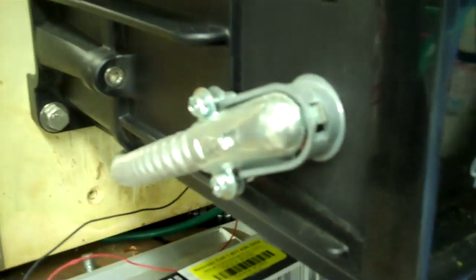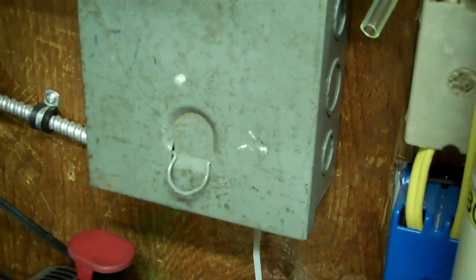It comes out of the inverter in this MC cable, which is 10-2 with the ground. It comes down here — this is where it gets goofy. It comes to this 30 amp automatic transfer switch. What it's doing is it's holding the contactor shut, so if the inverter were to go out or power would be interrupted for any reason, this cable goes to this transfer switch — it's a double throw switch. This one happens to be automatic, so if the inverter goes out, it switches over to the grid.